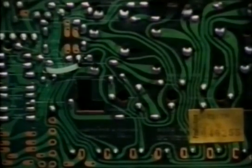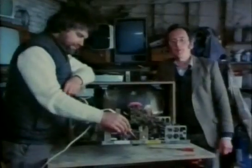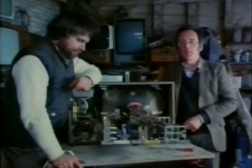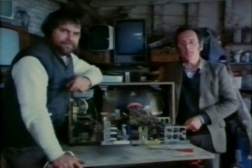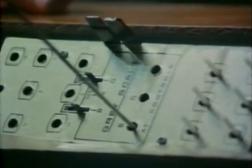You can then narrow the fault down to a few suspect components. We've managed to get a picture out of most of these old scrap tellys. From the outside, they don't look very different from modern tellys, but inside, things have changed quite radically in the last 15 years. For a start, the old televisions needed an elaborate set of adjustments. There were so many knobs that they were rarely set up accurately.